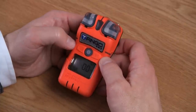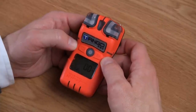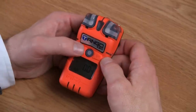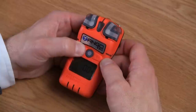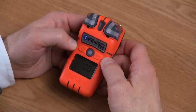Pressing the on-off mode again takes you to your time-weighted average screen, which shows you your average reading over the last eight hours. To clear this, simply press your enter button. Pressing on-off mode again takes you to your STEL screen — your short-term exposure limit — which shows your gas readings averaged over the last 15 minutes. Pressing on-off mode again will take you back to your real-time operations screen. Keep in mind that one or more of those screens may not appear depending on your instrument configuration.